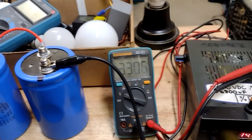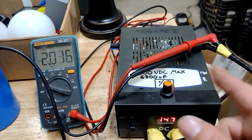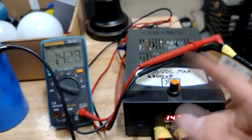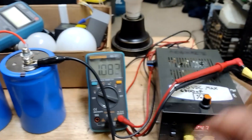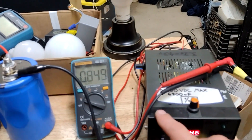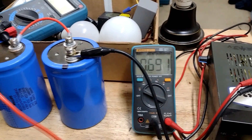Another version I'll probably build will use a comparator to regulate the output voltage — that's Tesla Unmer's idea. I'll spend some time building a really nice output transformer and make that voltage very precisely regulated, so you can set a particular voltage and have it climb up quickly or slowly. I'll also put a milliamp meter in-line to actually show the leakage in the process, so that becomes a very cheap capacitor reformer and basically a leakage tester — without having to spend thousands of dollars.